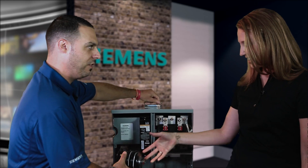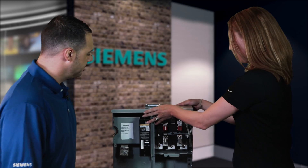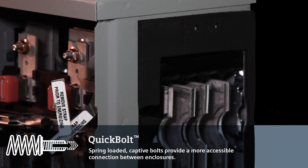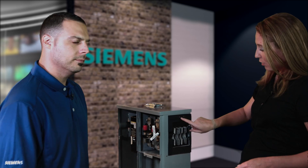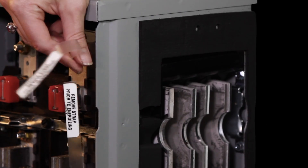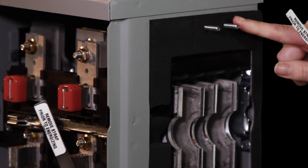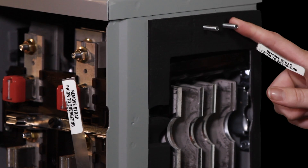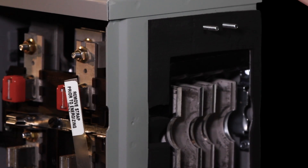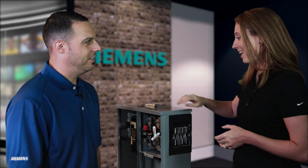What other quick system feature sets do we have? Our third one is QuickBolt. If you take a look at the outside of the QuickConnect module, we have four factory-installed bolts. When you pull this, those bolts protrude. So when you have an adjacent meter stack, push them up together and the holes will line up, creating your mechanical connection between the two modules.